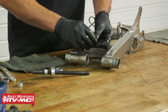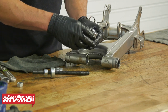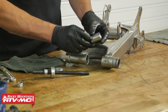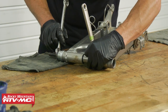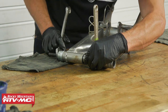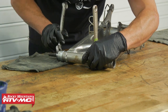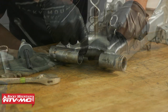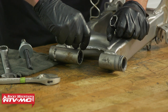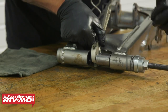To install the inner seals, you can use a small bearing driver or a socket that fits the outside diameter — pressing against the little metal ring. Sometimes you can press them in by hand, or use an extension through the bearing to press it into place. The easiest way to get it squared up is to use the tool again and just pull it in. Our seal sits just barely past flush on the swing arm, but some may sit in 5 millimeters deep, so again measure your depth. Then do the same steps on the other side.